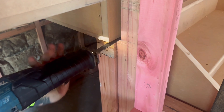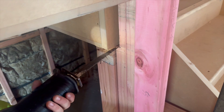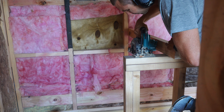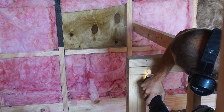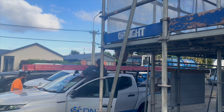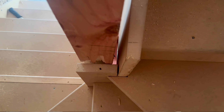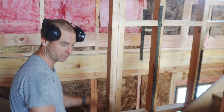Now we're going to cut off these studs. Tim is here. I'm going to buzz this one down to about 35 mil. We'll rip it down because down here we need ideally a 10 mil gap between the staircase and the framing so that we can get our lining down there.